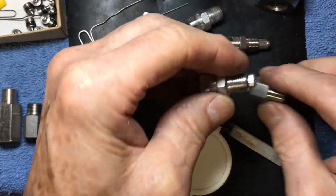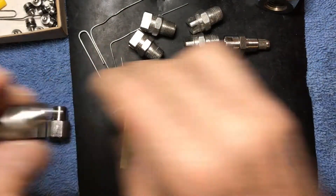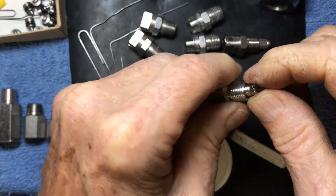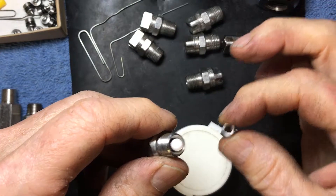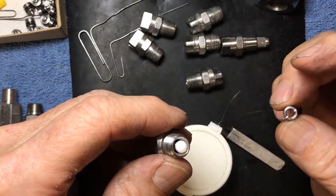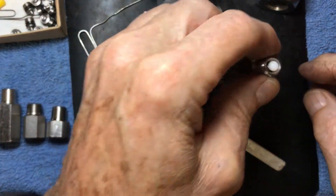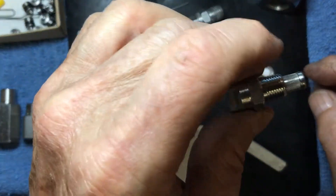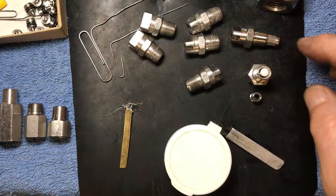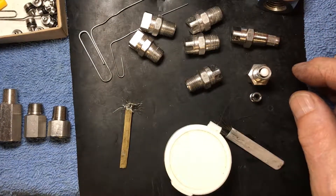The problem with the original stubby cap — it's got a big old hole through it, doesn't it? It doesn't filter out much in the way of debris — like nothing. Whereas the jet screen cap is about 95% effective. You still get some stuff through, still get clogged jets, but not nearly as often.